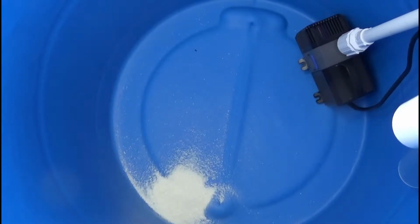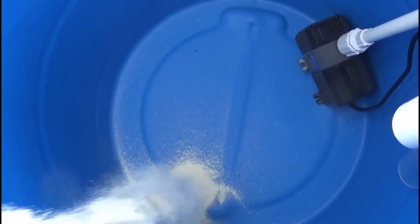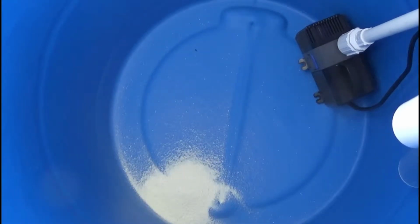And one thing that I've learned over the years that you want to keep in mind when you are doing your pump system, whatever you've got going in, you want your drainage to be the absolute minimum about 1/4 inch larger, or ideally you want it to be twice as large as your pump, because your drainage system, if it's like mine, is going to rely on gravity to drain it, whereas the pump is going to be force flushing it through. So you're most likely going to have a lot more water going up into your system than you will be draining down. So you want to have a drain system that is as large or larger so it can accommodate that drain off, so you don't flood your own system, because that is going to make the missus very, very angry to have a very wet floor.